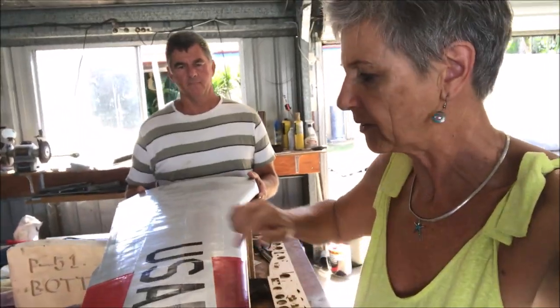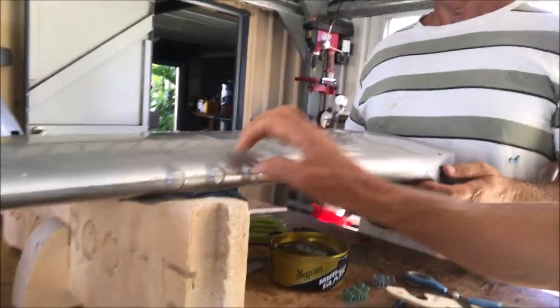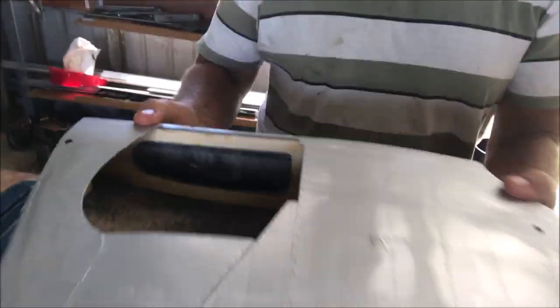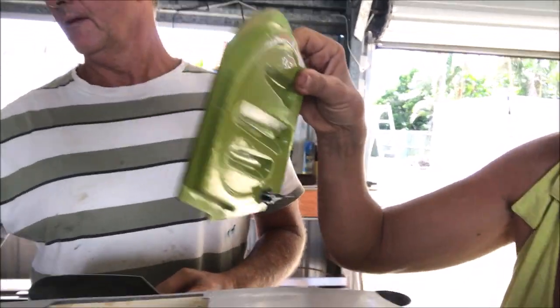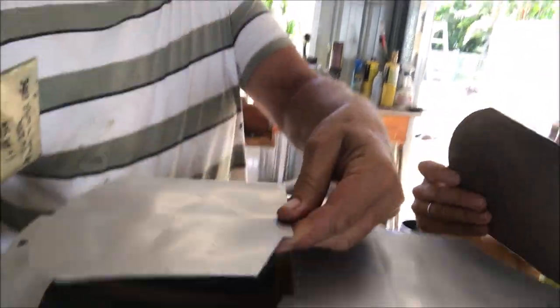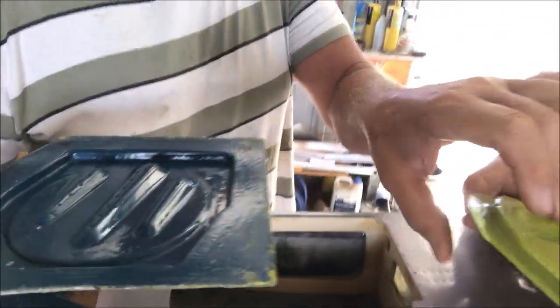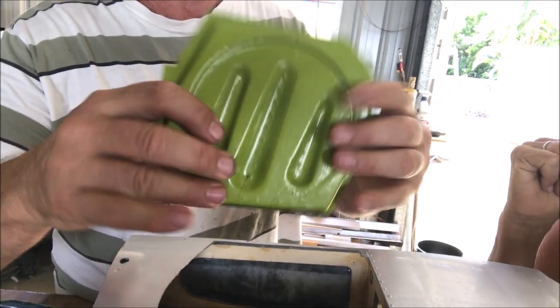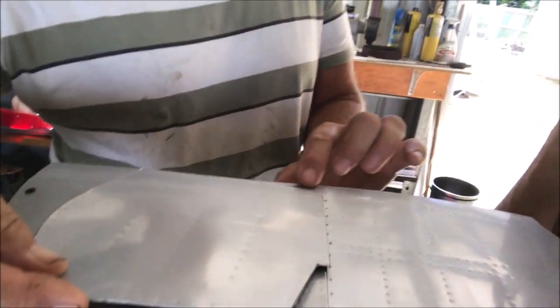We've also been doing a bit more work on the right wing. A little bit of trimming started on the trailing edge — we've cut out the clamshell door. The clamshell door has an inner piece; this is a finished one off another model, it's a 3D shape. So what we cut out is just the floppy skin, and then we lay up another piece inside its own mould which gives it solid structure and depth, while still being extremely light — two skins.